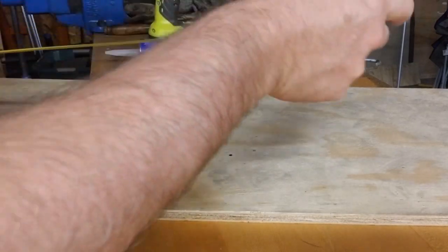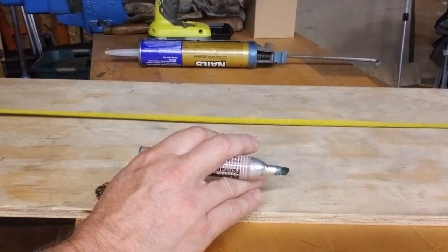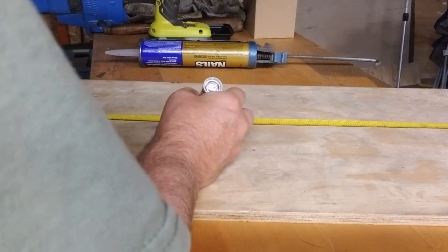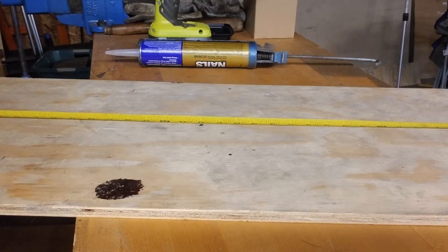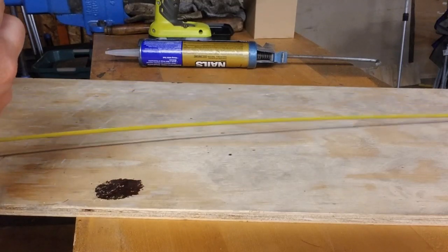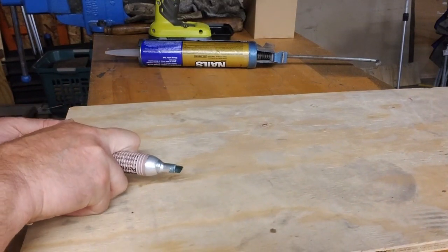Now, we're going to make the piece 20 inches, all right? You're going to lose 4 here and 4 here because of these holes, but we're not going to do that. What we're going to do is measure up and mark at 2 inches. Then we're going to come to 20 inches, which is 22 inches because we lost the 2. Then we go another 20, that's 44 inches. So you can see we can keep one of the holes out if you look all the way down here. This one keeps one of the holes out.